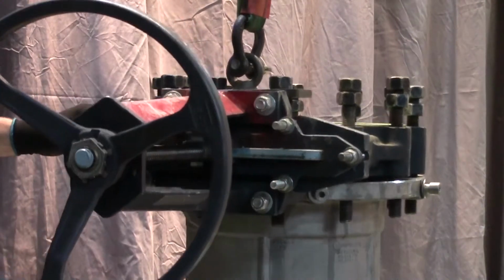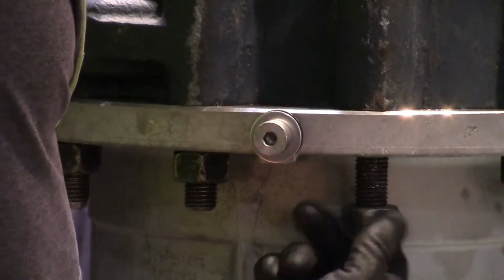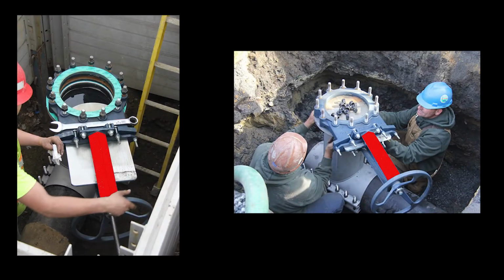And 12-inch IV250s use the 12-inch temporary gate valve. Temporary gate valves are single-direction valves and must be positioned top up. The 12-inch temporary gate valve must be installed with the red bar facing up.